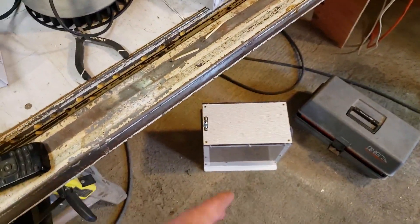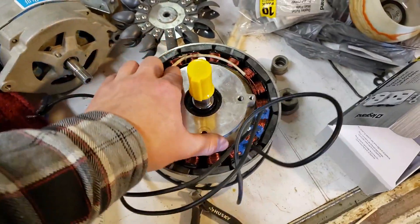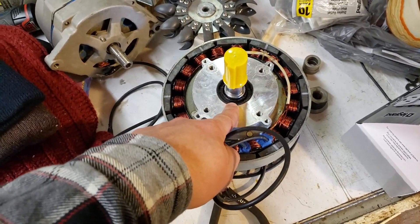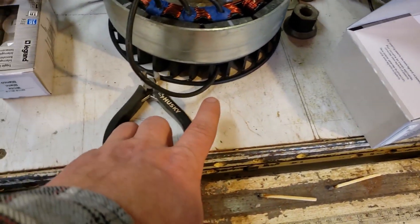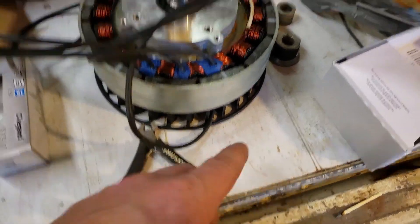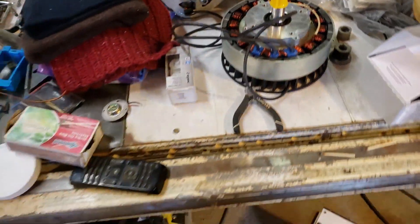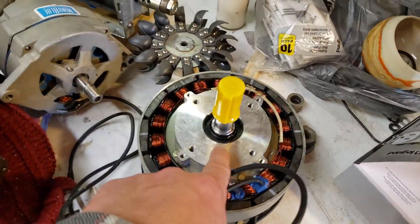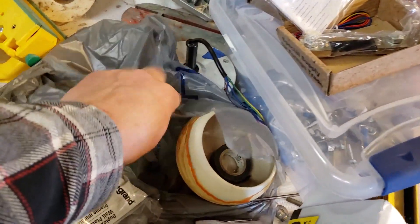I took out the turbine because I'm going to try reducing the friction on it — switching from sealed ball bearings to shielded ball bearings with a grease fitting, removing a thrust washer, and also removing the cooling fan. It will only be running in winter and at about half its capacity, so it won't need cooling. I also plan on dyno testing these motors.